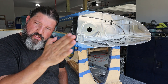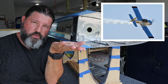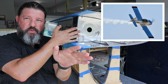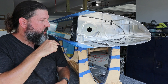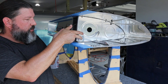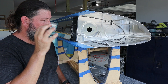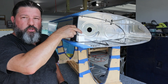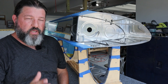If you're doing this kind of flying — like a knife edge pass — and you're counting on the flop tube working for sustained negative G flight, fuel can rush out of the first bay during that knife edge pass. If you do it long enough, it can empty out the first bay, and then when you go inverted, even though the flop tube is where it should be, there might not be any fuel in that bay. The trapdoor allows fuel to easily come in, and in situations where fuel might want to rush out, it prevents large volumes from leaving quickly. It's not a perfect seal and you don't want it to be — you just want to prevent a large volume of fuel from leaving the bay rapidly. It also has a little stopper so that when you roll wings level it doesn't get stuck open and become ineffective for your next pass.